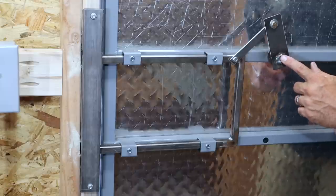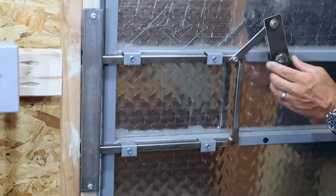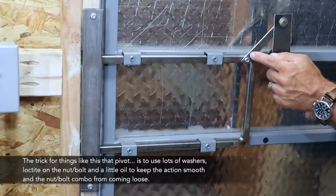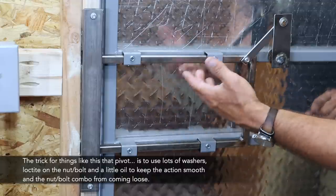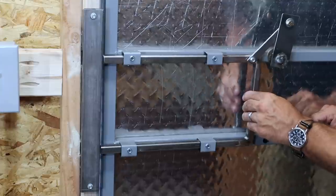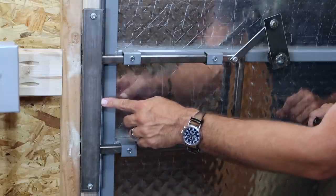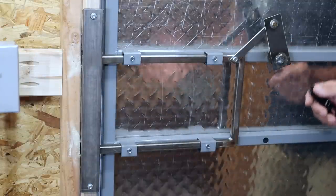The sign on the other side of the door essentially has an axle that comes out right here, and I welded this piece of scrap steel to it. When the sign turns, this turns, and that pulls another scrap piece of steel that is connected to the U-shaped piece. Ultimately it gets trapped into two little notches that I notched in the door frame and then gets secured behind this one-inch by half-inch piece of steel tubing. I'll show you some extra views of how all this works, but that is essentially it in a nutshell.